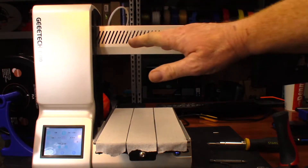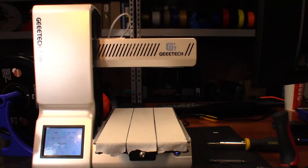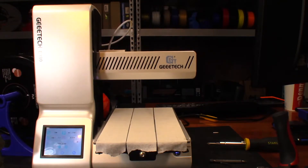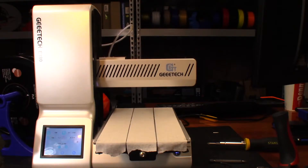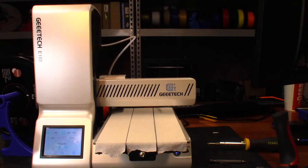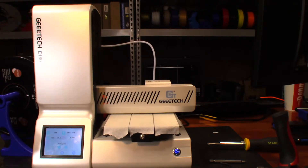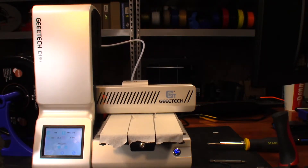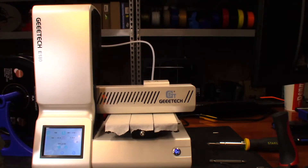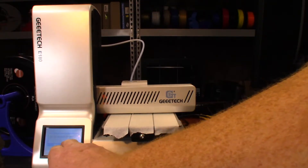The trick is it homes up here because that's where the switch is, and then it calculates how far down to go for printing. I'm just going to let the thing heat up, let everything get to the point where it's going to start printing the first layer and see how the first layer starts to print. As you can see it started printing - look, it's tearing up the tape because it hasn't been set since I just did a software reset. I'm going to go ahead and kill it.